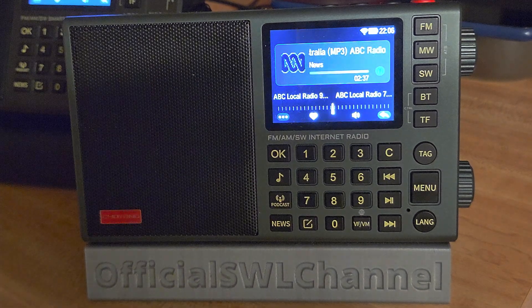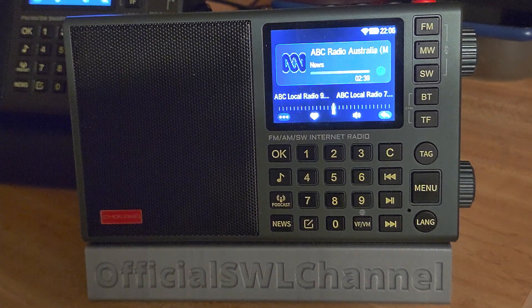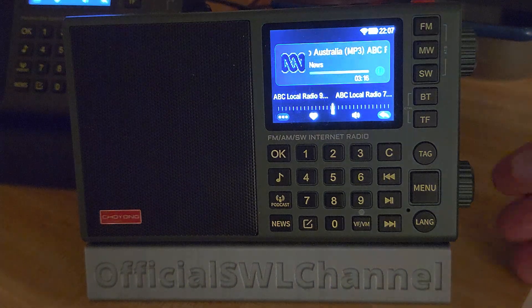If you do buy one, I would recommend that you look at the shortwave side first — tune a known station, even better maybe WWV time signal. Any known station where you know the frequency. Just make sure that you have the radio on the frequency and it sounds right. Tune a little bit out and back to see if it sounds really the best on that frequency, just to make sure the radio is on the correct frequency. If it's okay, then you're fine — you've got a radio that works well.